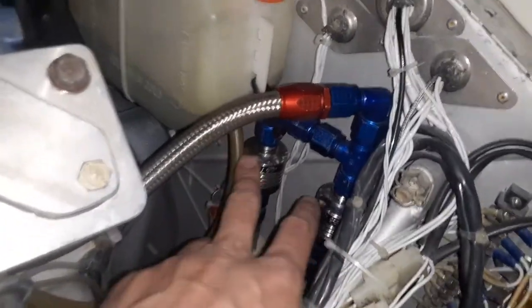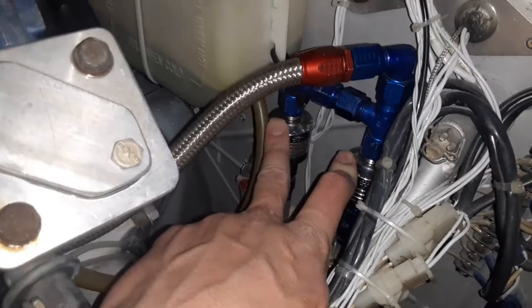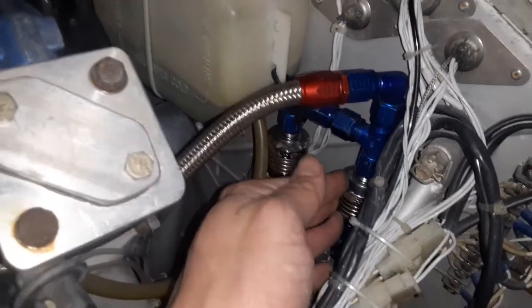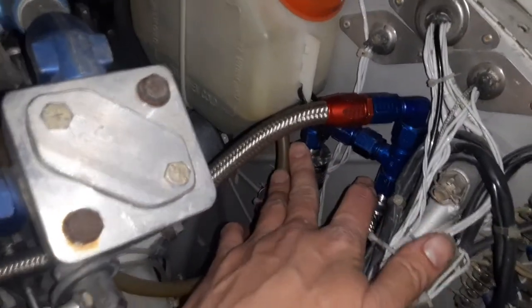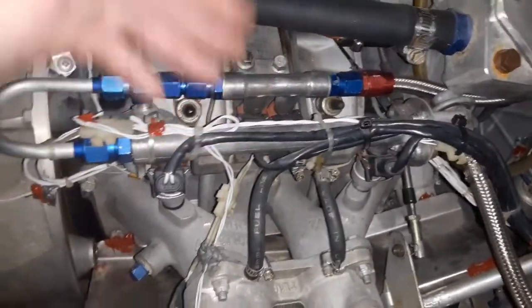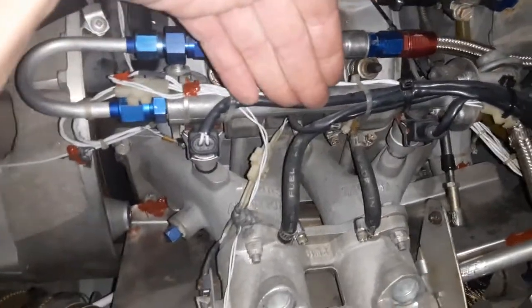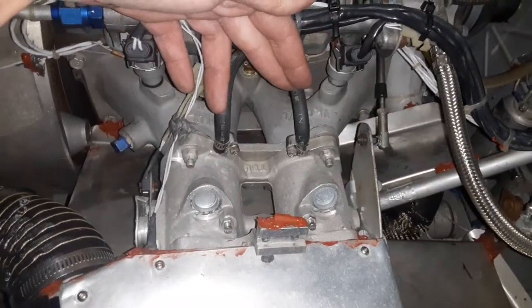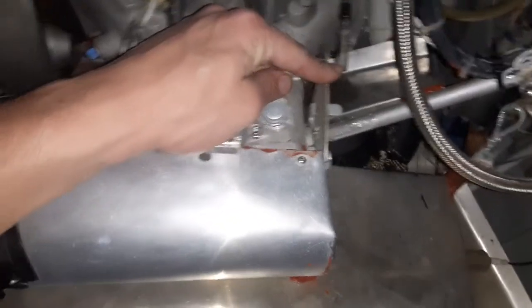These are 10-micron reusable filters with bypass, so if either one fails or stops up it cannot interfere with the other one. They are individually controlled in the cockpit. These are the fuel rail primary direct-port and secondary injectors, fuel pressure sending unit, landing gear warning light switch, manifold pressure pickups, and throttle linkage — spring-loaded to stay open if the linkage broke.